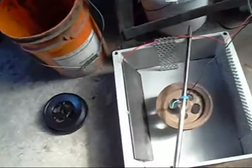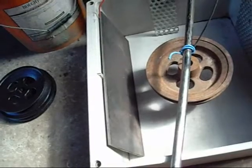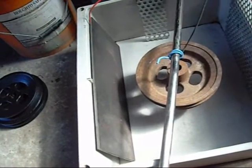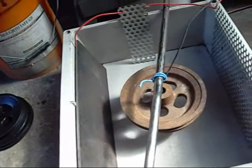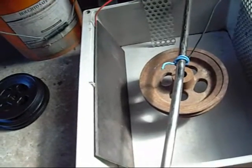Non-ferrous metals I would not recommend putting in — it has a tendency to attack aluminium pretty quickly. Generally just stick to ferrous metals. Painted is fine; paint comes off very easily in this system. Rust, grease, grime — it generally all comes off.